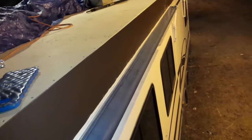As you can see I have the transition up and stapled down on the bottom edge into the fiberglass. I use quarter-inch staples — quarter-inch leg — for that. It's just stapled into the fiberglass because there's metal underneath. Underneath this is butyl tape, black butyl tape.